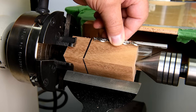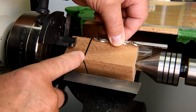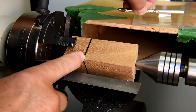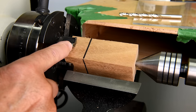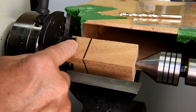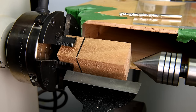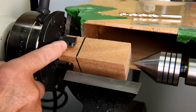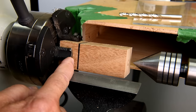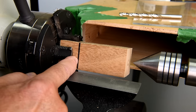I think you can probably see my dilemma here. If I just leave this line, the hole will not be exposed at the bottom of the little stand. However, these jaws are not designed to hold something way out here on the tips. And if I go in like this so it has a little better bite, then my tool is going to be extremely close to these jaws — like the parting tool, for instance, when it comes time to part this off.